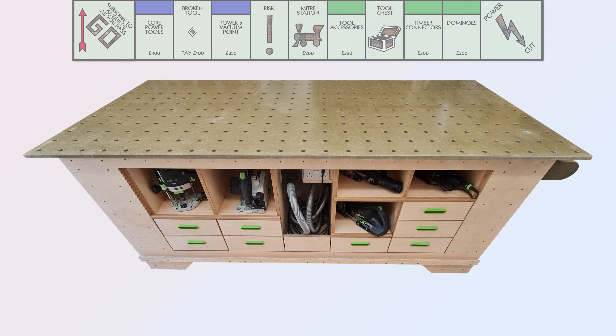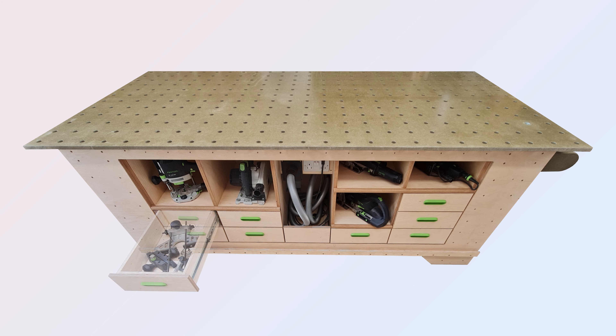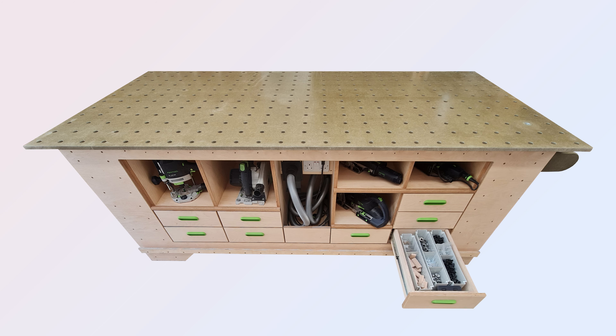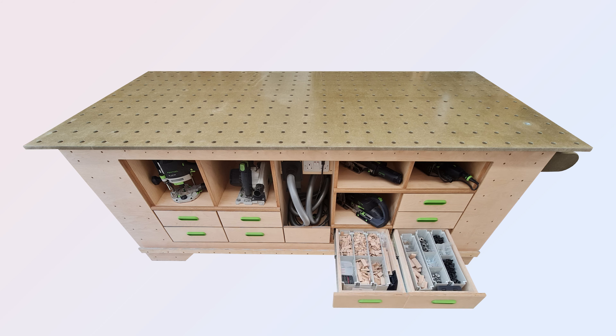The next best space, or the green group, is the lower half of the front of the bench. I wanted to use that for the accessories for my tools so I could set up and use a tool without moving more than a single step. I have my router accessories, room for expansion, saw accessories including items for the table saw, domino tool accessories like the FC Tools DCS plate, dominoes for the small domino, bench dogs and rail system parts, jigsaw accessories, and the large domino connection system. Each drawer is a little larger than a Systainer so, where desirable, the entire Systainer contents and plastic tray can be inserted as is.